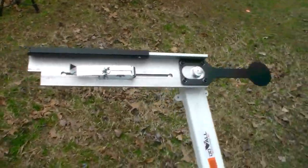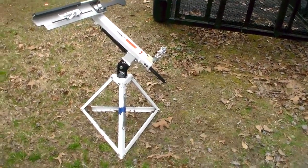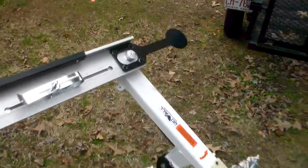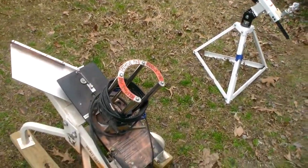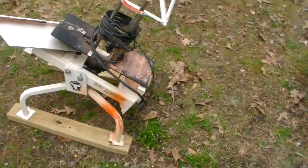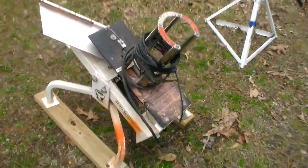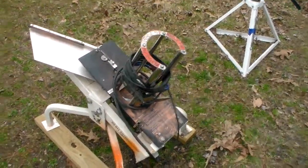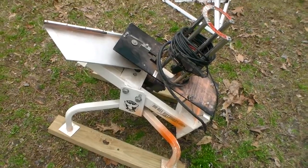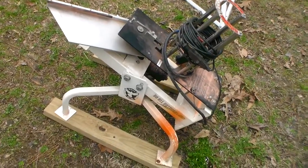I haven't had any problems with the Clayhawk — I've only had it a little over two months, but so far so good. I believe the throwing head is guaranteed for something like a million throws, and I don't think I'm going to use them up. The only problem I've had with the White Wing in 10 years was about two months ago — the main relay in the panel went out. I ordered it for 18 bucks, got it in less than a week, and it took about 10 minutes to put in. Pretty much plug and play, and that was the only issue in 10 years.